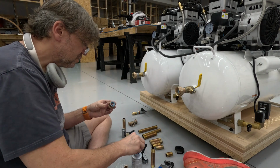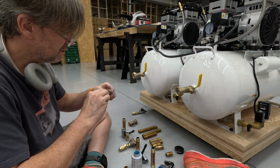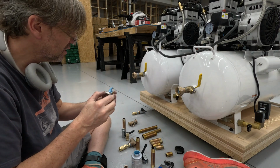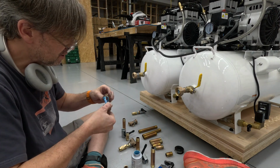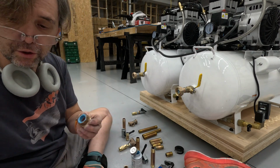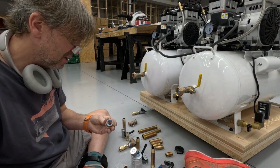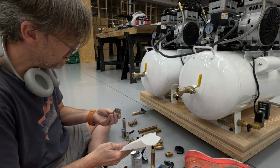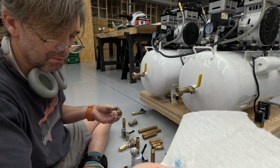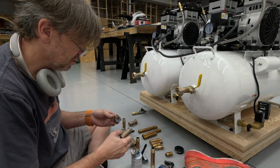This Rectorseal seems to be larger, not thicker, but with less work, you really don't see any of the threads. And I'm assuming that by pushing in, I'm getting penetration into the threads. The reason I'm thinking that is beneficial is because I want to leave as much packed in the threads as possible, obviously.